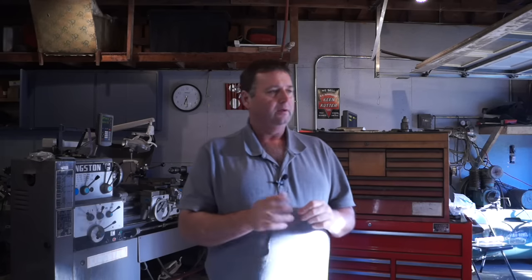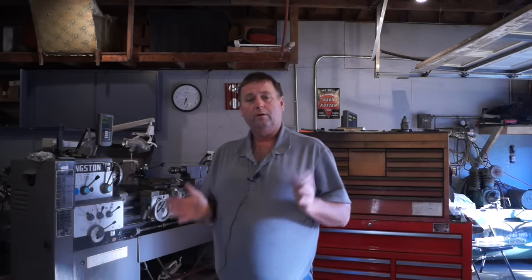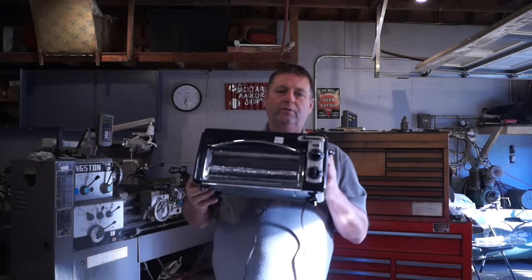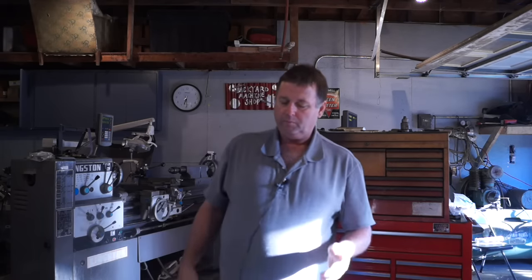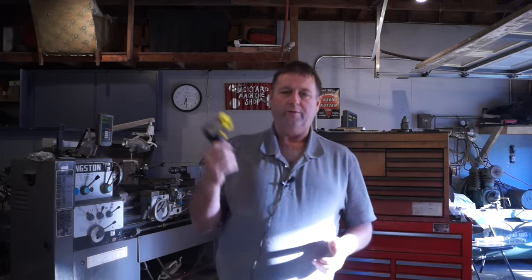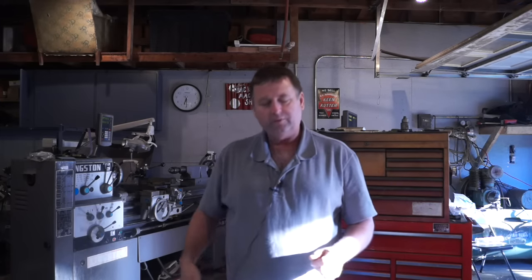That video was shot a month ago. About 2 weeks ago, when I had some time, I tempered them. The book said we need to heat them up to 425 and hold it there for 4 hours. So I went down to the local thrift store and purchased a little toaster oven. It's got a 450 degree range, and I turned it to 425 and placed the parts in there. I took my little Harbor Freight thermal imager, and every now and then would open the door and shoot it. Consistently it was 415 to 428, somewhere in there.